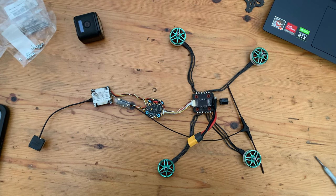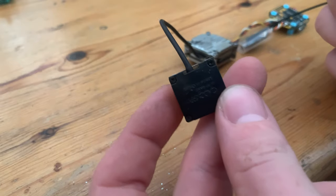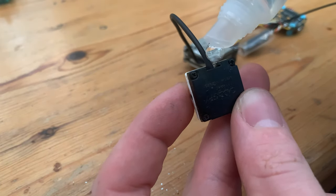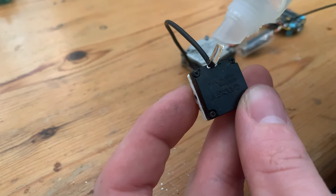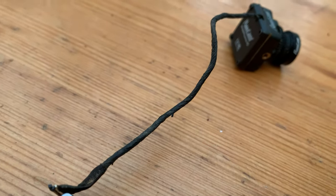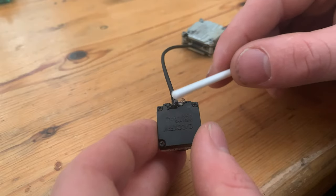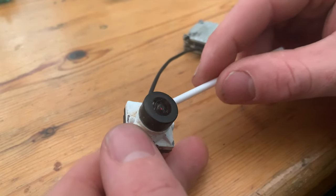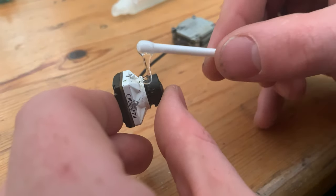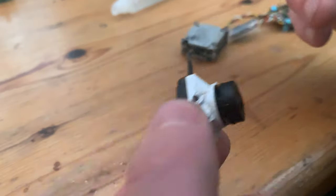The first thing you've got to do is take your quad apart — don't unsolder anything, make sure it's all still connected, flop it out on your desk like a big octopus of FPV parts, and then you're ready to start applying FPV Worry Free. I started with the camera, the Nebula Pro — all you need to do is seal up the little hole between the cable and the camera. I changed the coaxial cable to proper silicon wire like the one that comes with the DJI cameras. Apply the Worry Free around the cable, plug up that hole so no water can get in, and optionally put Worry Free around the lens as well. In my experience crashing into water with an analog quad, every single thing has been fine after drying out except the camera — once water gets into the sensor, say goodbye to your picture quality.